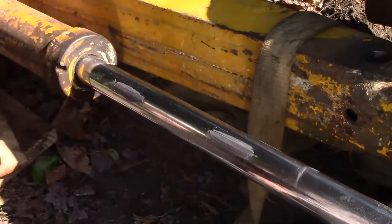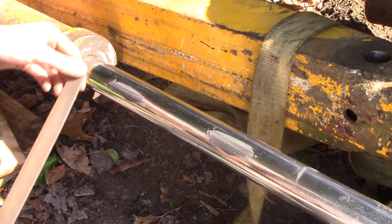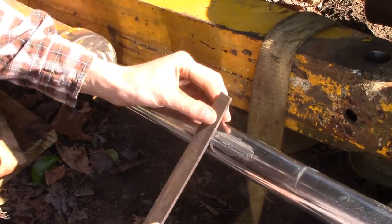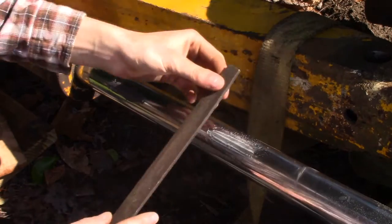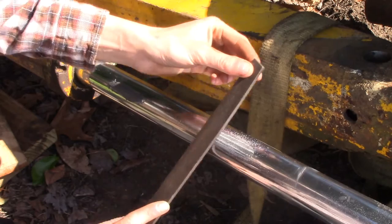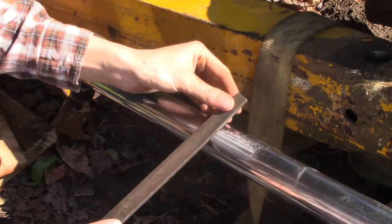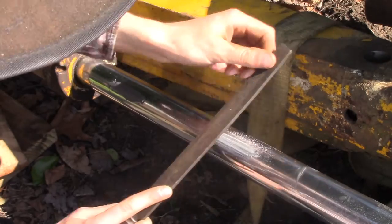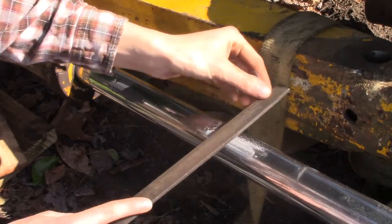The epoxy has been curing for a day or two, so it's ready to be finished. I'm going to start out with a file to take off all the high points. Don't focus in one spot too much — do one stroke, then angle the file a little bit, another stroke, and just go at it nice and easily and evenly. Don't be in a rush to take off too much at one time, because then you'll make flat spots and have to do it over again.